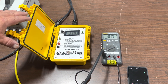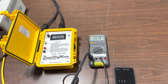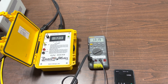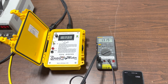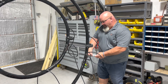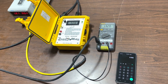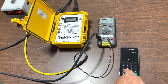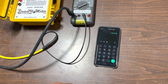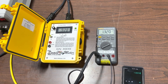So here we have a value of 0.926. And over here on our multiplier tag, in the 2 amp range, we have a multiplier of 1.43. So we are going to multiply 0.926 by 1.43, equaling 1.324, in comparison to the 1.32 on the inline meter.